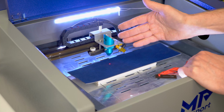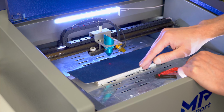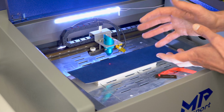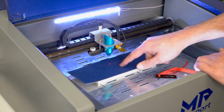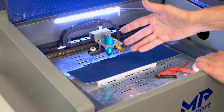It's not until I move the laser up a little bit, or in this case, pushing my work material down a little bit to defocus the laser, that now I have a little bit more settings to play with that I can easily engrave through the blue layer and not burn all the way through that silver foil directly underneath.